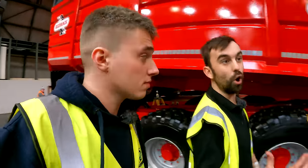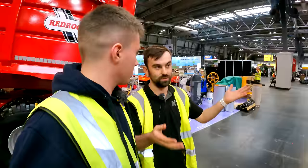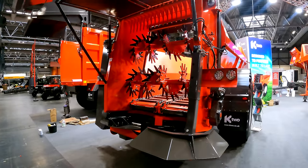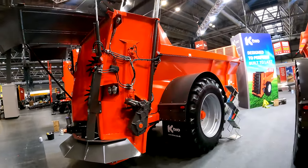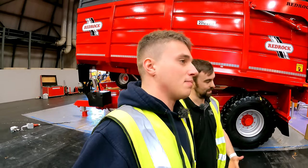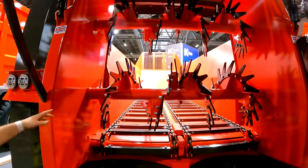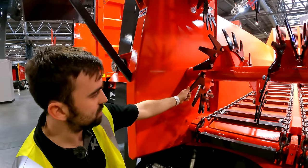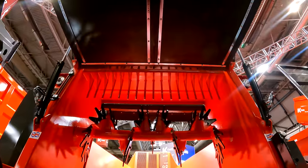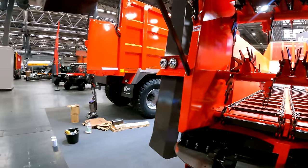The creme de la creme is the Bio — also a 16 tonne machine and one of two demonstrators for the year that will be going around the UK. It's a horizontal beater machine that churns muck and feeds it onto two 1100mm spinning discs which can throw it up to 32 metres. They use a flared rotor design with sections of three boltable teeth for abrasive action, plus fingers near the top to filter material through. The doors are rubber-lined to stop stone chips and prevent rust.